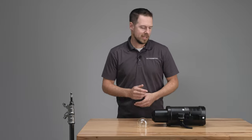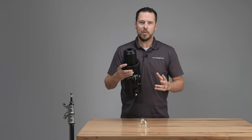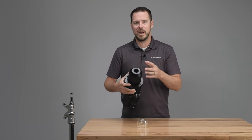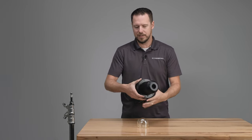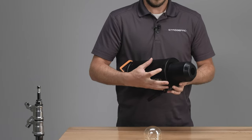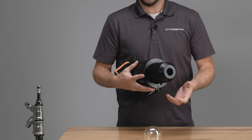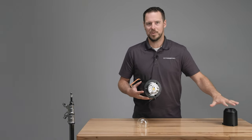We're ready to install our glass protection cover, and to do that we need to remove the plastic cover on the front. We've had a lot of people in the past who have actually melted these thinking that they're snoots or something — so please, the first thing you need to do is remove this cover. Whenever this gets powered on, even for a few seconds, you have to make sure this cover is taken off. There's a release switch right here — pull that back, give it a quarter turn and it's going to come right off. It's a Bowens mount so it goes on just as easily. I can't stress enough: this is not a snoot or some type of modifier.